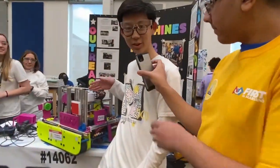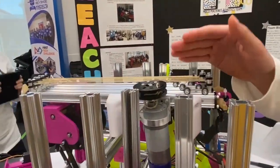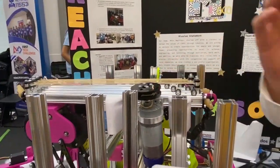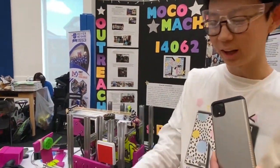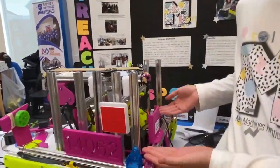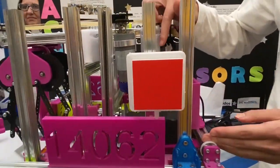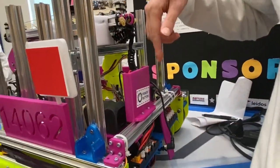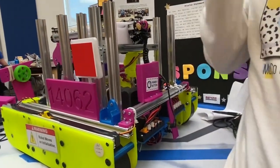As you can see here, this is our decoupled elevator. We wanted our robot to be able to stack at least two blocks high, and since our hand grabs directly one block, we didn't want to put it at an angle. So we wanted to move the whole arm up and down, which is what our elevator does. There's a DC motor at the bottom with a timing belt around it, which drives two lead screws, which moves the whole robot up — and that way we can stack.